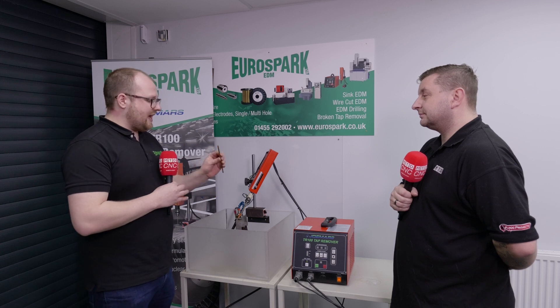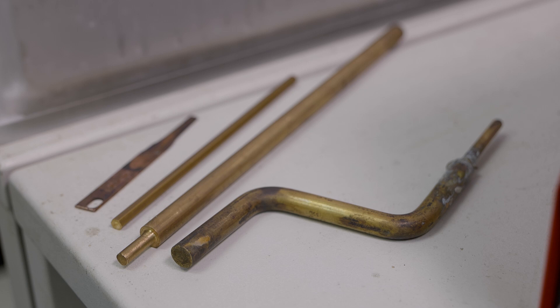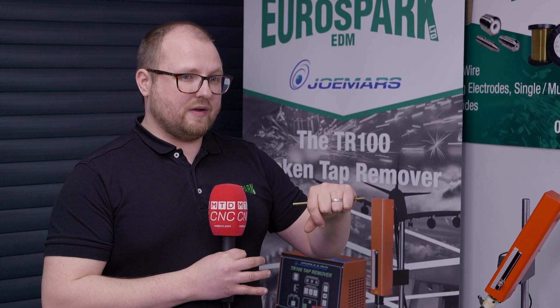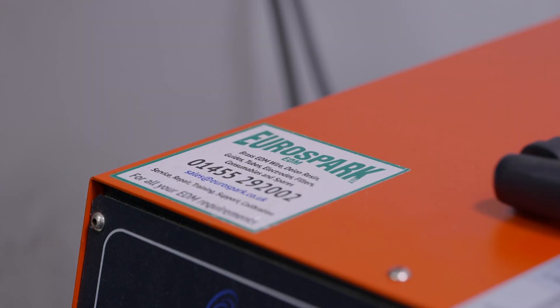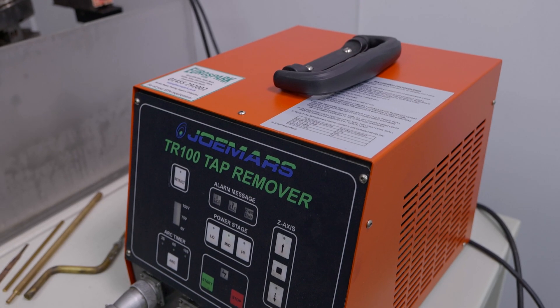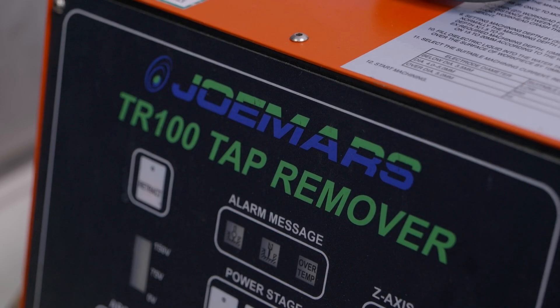As I mentioned, you can spark a form in — whatever form the electrode is, that will go into your workpiece. For really large bolts, taps, and drills we suggest the first thing you do is try to put a hex in it and lever it out. If that rounds off, next thing to do is try to split it with a blade straight down the middle, or fully erode it. One of the great things about this unit is we also offer support — if you were in a bind you could call us and we can support you through the best setup methods we've seen. That support is free for the lifetime of the unit.